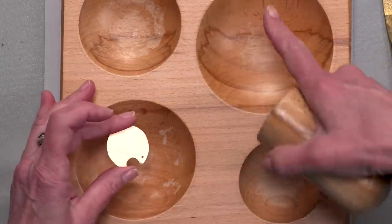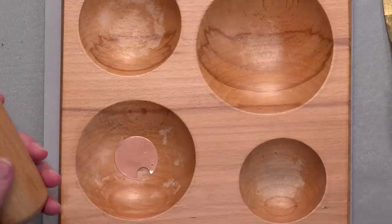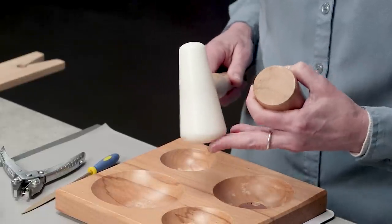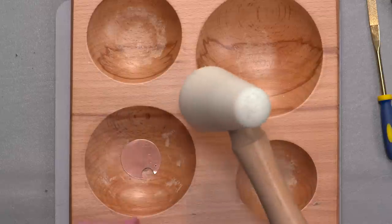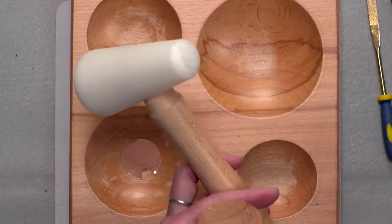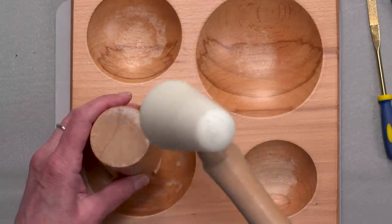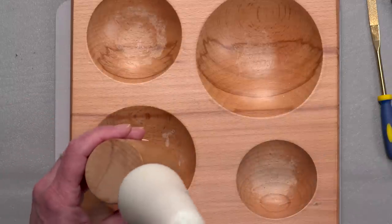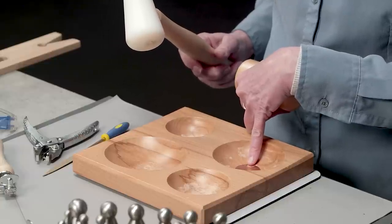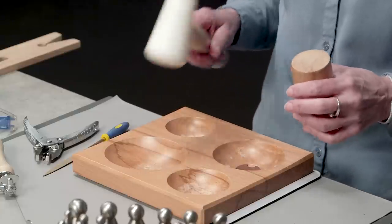Because this one is so large, I'm just going to go with this one right here. I'm going to be using this hammer — I like this hammer because it's tapered, it has a smaller head so that I can see what I'm working on as opposed to something larger. So what I'm going to do is go around slowly, because the metal is going to want to bend where the cutout is. I'm going to be really watching that to make sure I get a nice smooth dome.